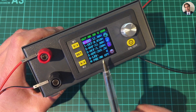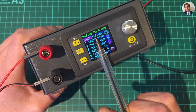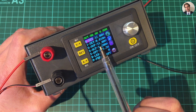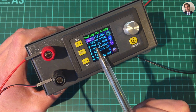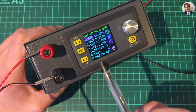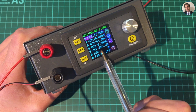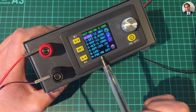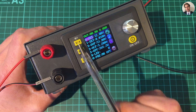There's also this 'Set' button that takes you to a little menu. First you can set the brightness of the screen - I turned it all the way down so it's more readable. Then USET - that's the preset output voltage, currently 12 volts. ISET - that's the preset current output, currently 10 milliamps. Then SOVP - over voltage protection, currently set at 51 volts. SOCP - output current protection. And SOPP - output power protection.